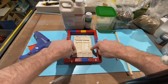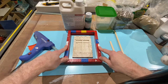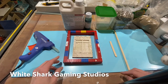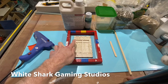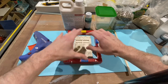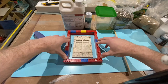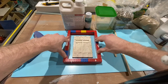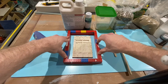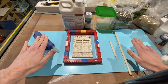What I've done is I've glued the actual piece to cast down to this plastic board, which I'll be able to get off afterwards because this is the plastic protection on top of the EPVC. I made a frame out of Lego that is notably higher than the mould itself. My casting guru friend Ian from White Shark Gaming has told me that I need to pour approximately a centimetre above the actual mould, so this will make sure I've got plenty of space for the mould to be deep enough so there's no problems of it flexing when I cast the pieces. I'm going to go round the outside with the glue gun to make sure this is held down so that the silicone doesn't seep underneath the Lego. It shouldn't get between the bricks too much - you get a little bit of seepage but it won't come out the other side. I'll have to leave it in place overnight.